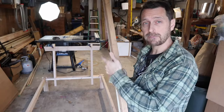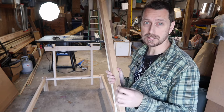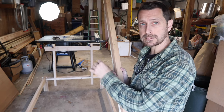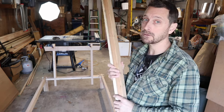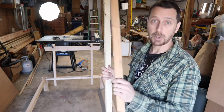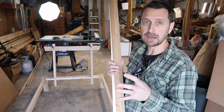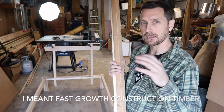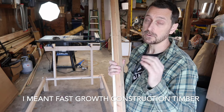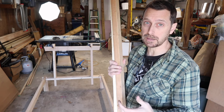Our bed is coming along, we have the headboard on. Now the next step is to get the mattress supports on. So we need rails along the sides for that support. Now you can do it one of several different ways. You can either purchase 2x2s, which can be a little sketchy because they twist a lot. Modern wood is really weak and it warps really easily. So you can cut those from a 2x4 if you choose to just buy 2x4s.